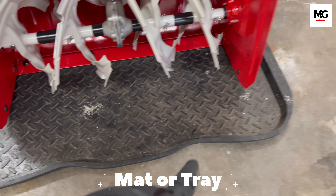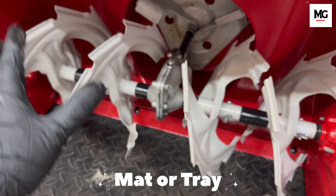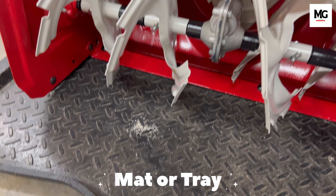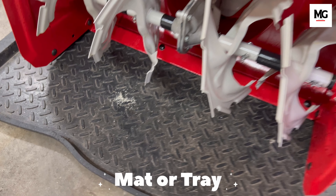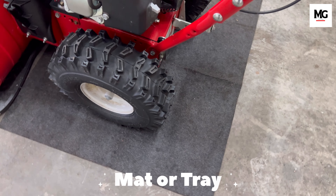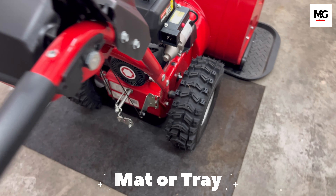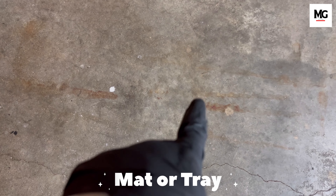You can get a couple of them for just a couple of bucks — they are inexpensive and you can purchase them from your hardware store. Do not use regular nuts or bolts instead of shear pins, because they will break your gear box. If you break one, no big deal — just insert a new one, tighten it down, and you are good to go.